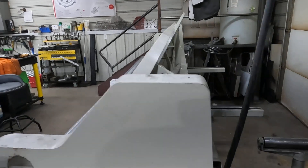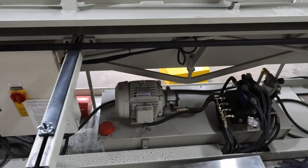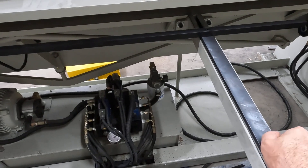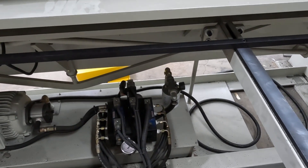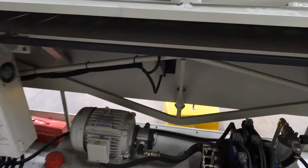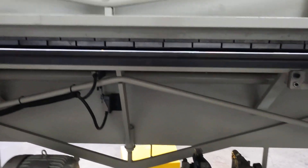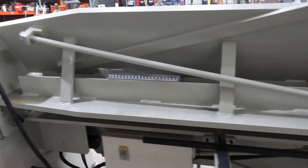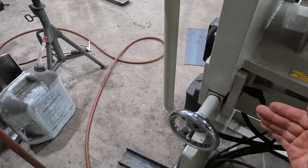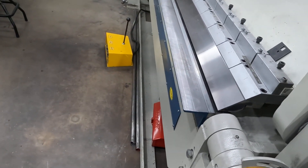Back here you've got the guts of the whole thing — your control panel, pump motor, and reservoir. This is your back gauge; it is just a thread-on so you can actually set angles to it, you can set it straight, there's just an end on both sides. Looking down inside there you can probably get within maybe two and a half inches of that outside piece, so if it's really short pieces that back gauge will not help you. And here is your threaded adjustment to bring the teeth of your brake in and out.